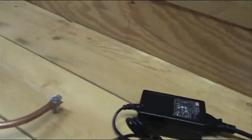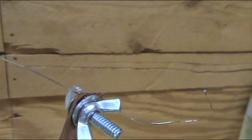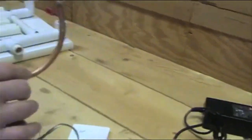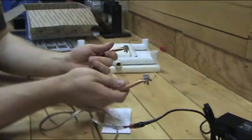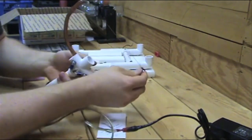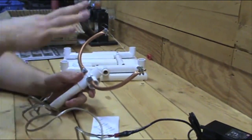Let's cut a piece of foam and take a look at this. It's got adjustable arms. Anytime you apply heat to a wire it's going to expand — that's a normal property of the wire. There are a couple of ways to account for that expansion: you can bend the arms out, or you can twist the wire just a little bit to put a nice amount of tension on it so it stays firm.